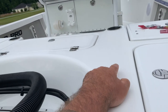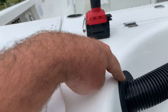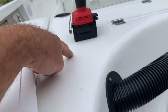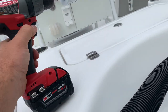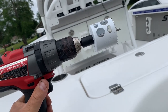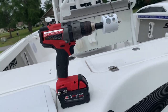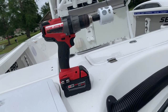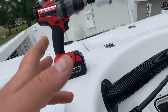I'm planning to put them in this location — one right about here. On the other side there are all my controls and everything that goes to the motor, so I'm going to go a little bit behind that so I'm not going to hit anything. I'm using a 2 1/8 inch hole saw — check with your hardware store and bring the item in to properly size. I did a test run on a piece of junk wood and the rod holder fit perfectly.